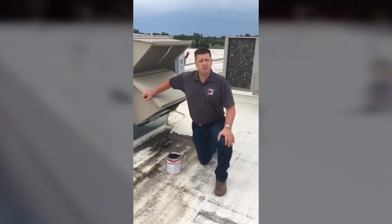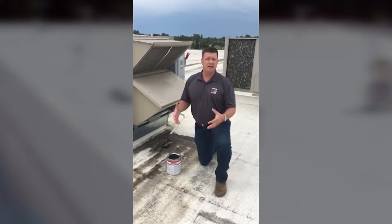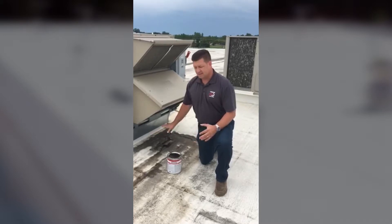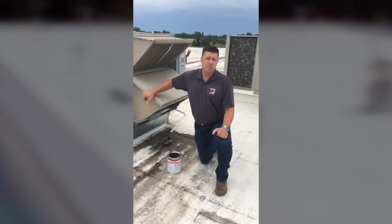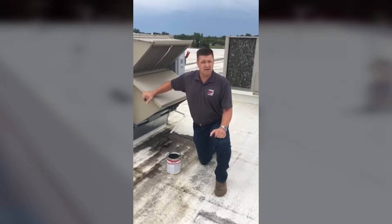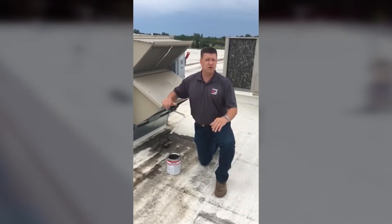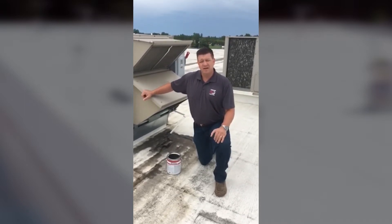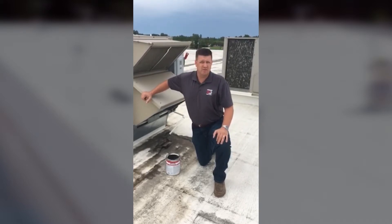Go ahead, do the roof system aspect, and then you can use Affinity in an application like this to take care of an area like this that's going to stay wet and moist a lot of the time. Not a good place for acrylics necessarily, but Affinity urethane coating on top of that is perfect to make sure you have that ultra shiny finish. It's going to hold up to that kind of moisture to get that away and towards the roof scupper and drains off the roof.